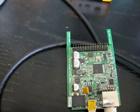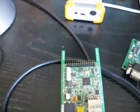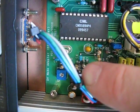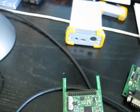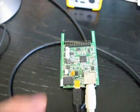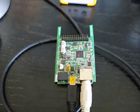With a difference — other modem boards, like this MoenCom board here and also my old Satoshi board in the enclosure, most or all of them rely on the CMX589 modem chip. What makes this board different is that the GMSK functionality is done in software using DSP, so there is no hardware modem.